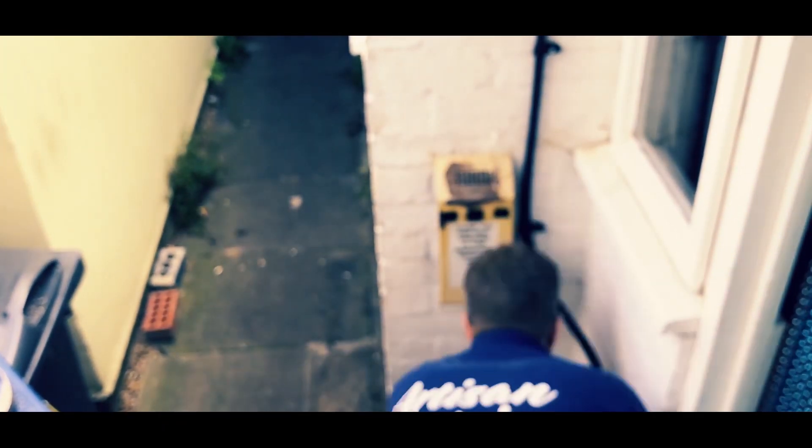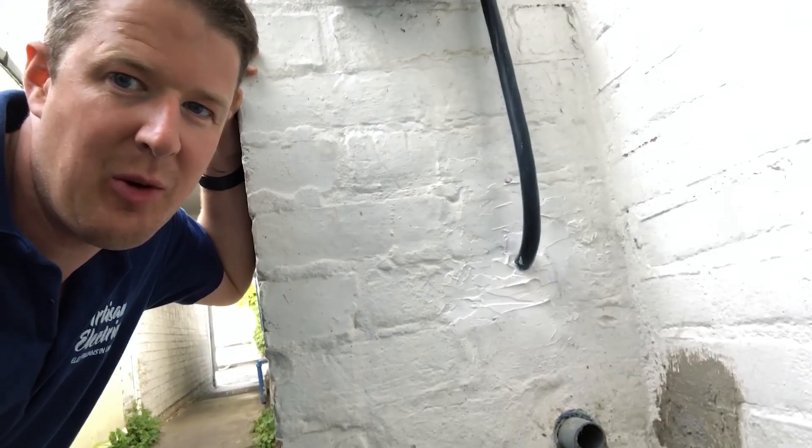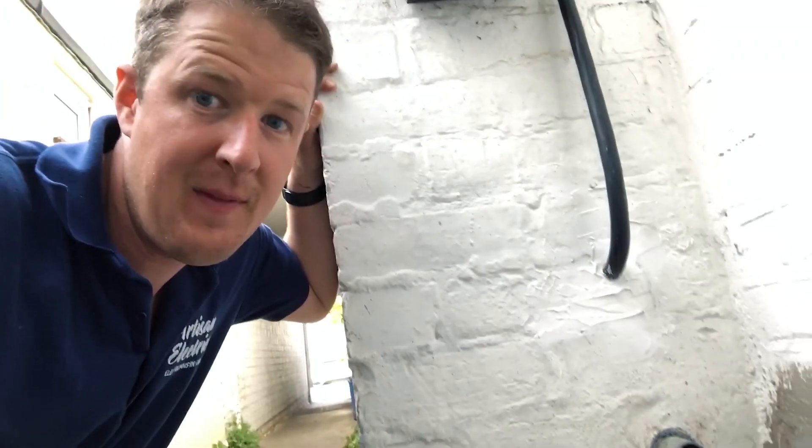I've made that good now - got rid of the horrible blown-out bit. I siliconed around the hole first to seal it waterproof, then went over it with some white filler. A fairly good finish.